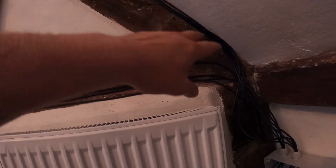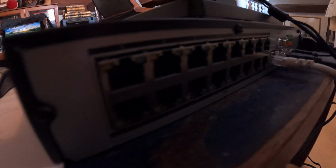Normally, the cables that you get from your cameras, say these five cables, would go straight into the back of the recorder in any one of those ports there. Okay, and the recorder would send power to it, and then the cameras would display on the screen. That's how you do it 9 times out of 10. That's what I've been doing for years. This is a lot more advanced.